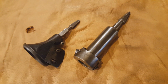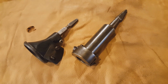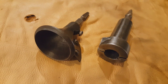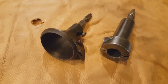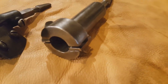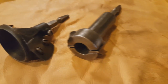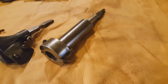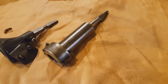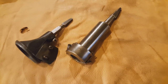The last two items to display today are a chairmaker's spoke pointer and a chairmaker's hollow auger. The spoke pointer is used for rounding over the end of a piece of wood very slightly, and then the hollow auger is used to form a round tenon on it. Hollow augers back in the 19th century were available in fixed sizes, and slowly but surely there were a number of patented adjustable ones as well — but that is a discussion for another day.